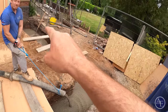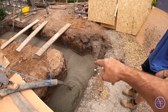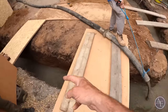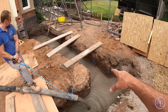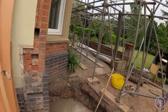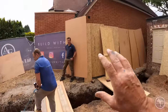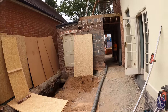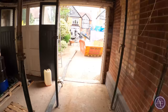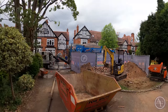We've just shifted the entry of the concrete from this point to down here and moved it around the corner — just to ensure there's an even spread. If we started moving this lump of concrete now there would be too much of a gush or flow of concrete down there. We need to reassess the position so we're trying to make sure it's evenly spread around whilst trying not to fall into the thing. We haven't tamped over there yet because we need to get a load of weight down here — once the weight is in, it will back itself up and we can start to tamp and level it all up. We've covered that window to stop getting concrete all over it, and we've got the volumetric mixer here with another 8 cube ready to go.